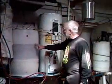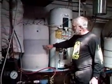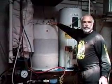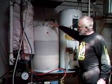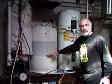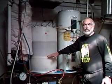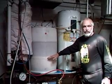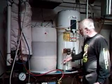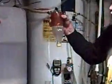This tank right here holds the esters of the fuel — it's a wash tank. I have some nozzles here that spray water, and the water goes through that fuel. As it goes through the fuel, it takes the impurities out — the leftover lye and alcohol and anything else in there — and it goes to the bottom. The water circulates to the bottom. This is my sample that I take so that I can monitor what's going on.